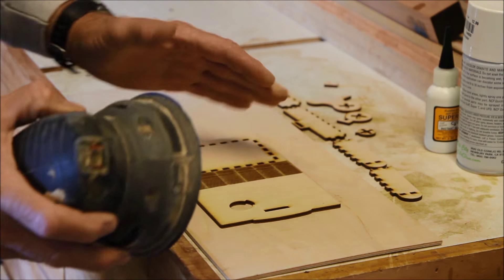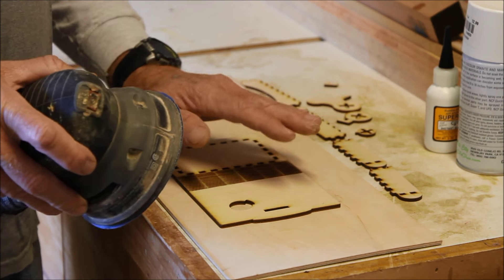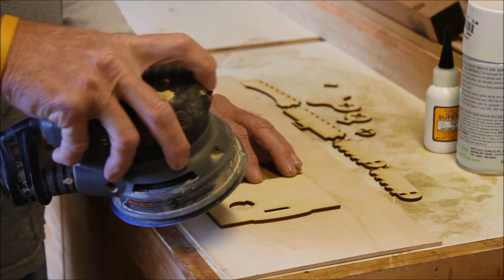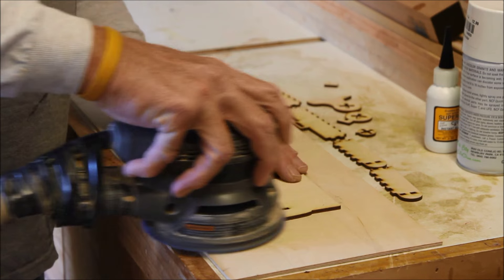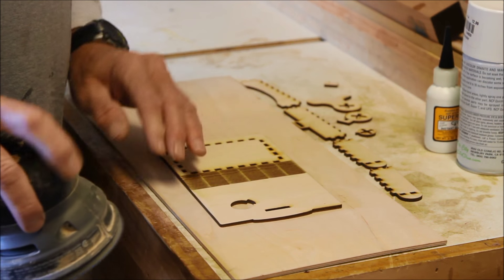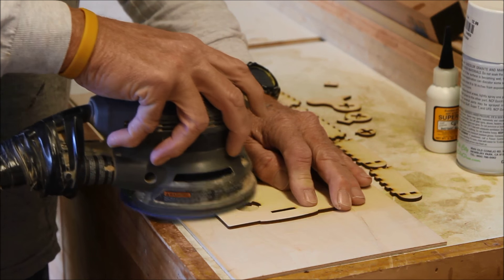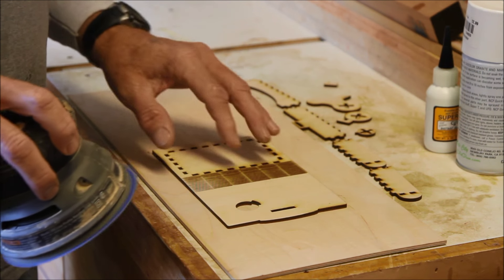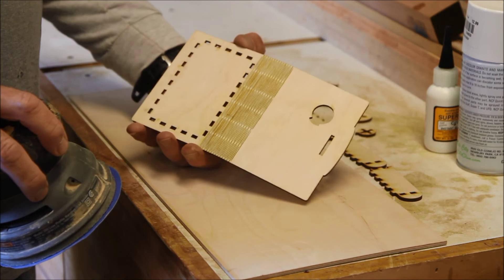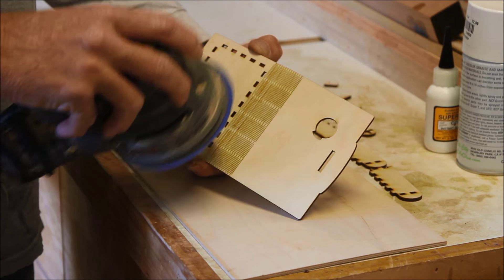I'm not going to take too much time, but normally I put the cut out part back in the piece it came out of to keep it from moving around. But if you just hold your hand down and keep your flex joint from moving, this is a lot easier. The flex joint is going to take some time. I actually elevated the work off the cutting surface so the bottom side doesn't have any back splash from the laser.